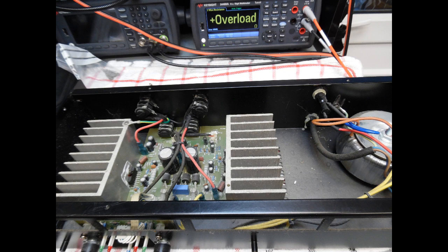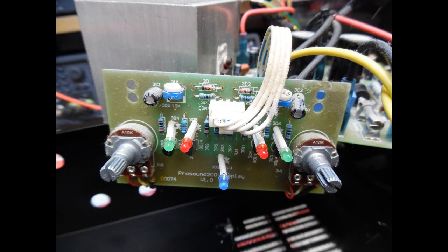Because of how much dust was inside, I also removed the front panel, which contains the volume control potentiometers and LEDs. There are two presets — normally used to set the LED operation so signal levels are equal for equal input signals — but these didn't require alignment. Once the amplifier was fully cleaned, the next step was to focus on the actual fault.